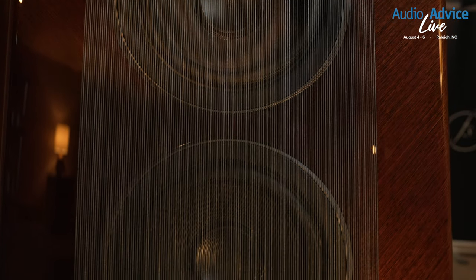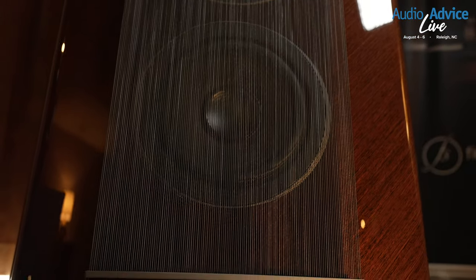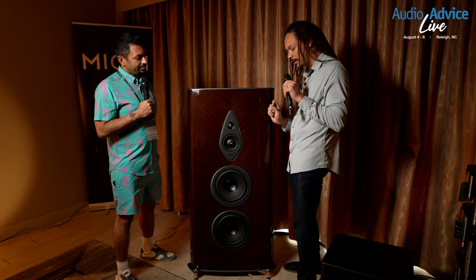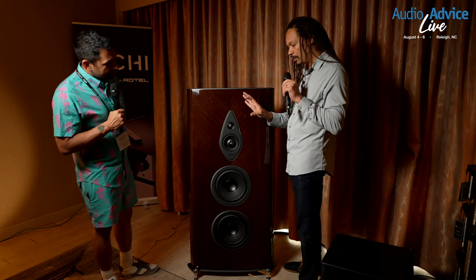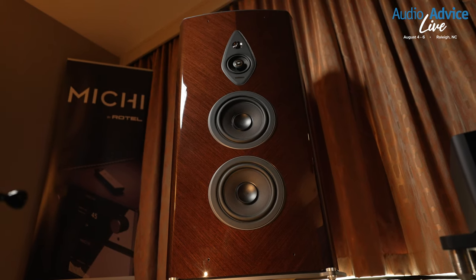But in a high-end audio configuration, we need to make sure that we're also adding detail and clarity and texture to that low frequency, right? So the real magic to this, and what was difficult and what we were able to accomplish, is we redesigned both the motor itself, the dual voice coil cylinder, and most importantly, the neodymium magnet slug.